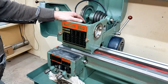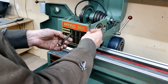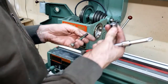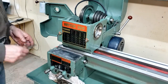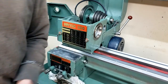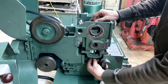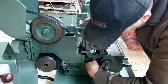Okay, this guy's pretty straightforward. He's got two screws from the bottom. Here they are. This cap screw comes from the front, and it gets a 15 millimeter socket, not a 14. Okay, yeah, 15 millimeter. This guy, I got up in there with this, just a long Allen key. It's going to be a bit inefficient. This is where the other bolt comes up. Held perfectly on the scribe mark.